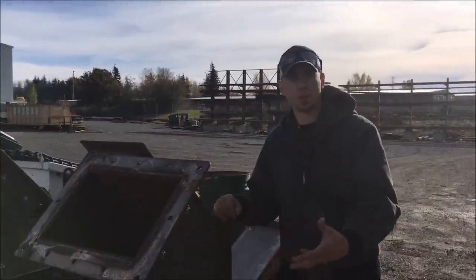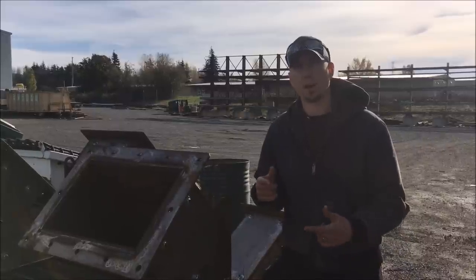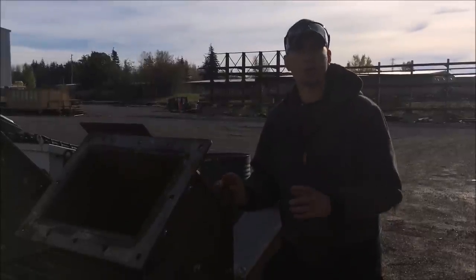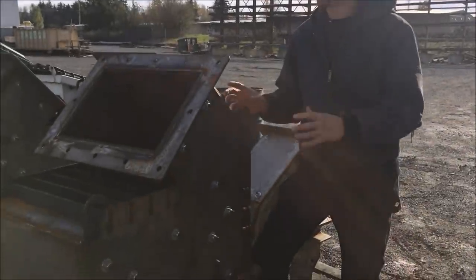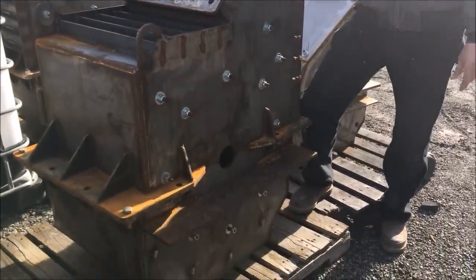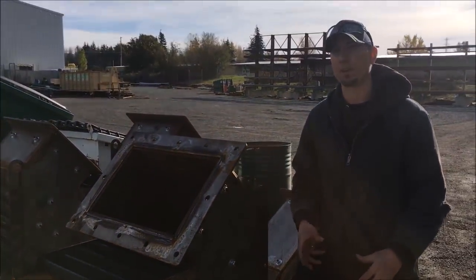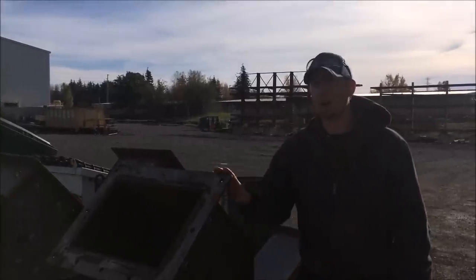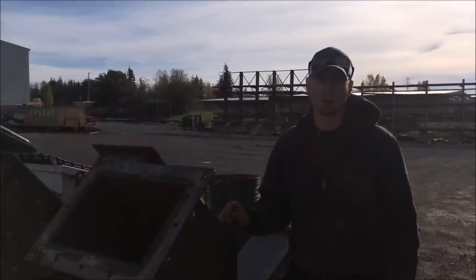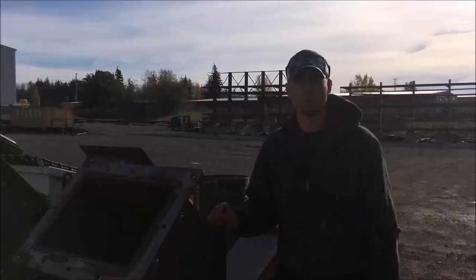The armor, the hammers, and everything in this mill is very easily replaceable just like on our standard mills. I wanted to clarify that the wear rate on these scrap metal or heavy duty mills is actually less than on our ore systems. In our ore systems you're grinding quartz or something very highly abrasive down to a very fine powder. Whereas with these heavy duty hammer mills it's more of an impacting motion and the material goes through the screen fairly quickly — you're not actually grinding anything. So the maintenance cost on this mill is quite a bit less than our gold ore or high abrasion environments.